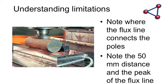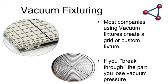The other question people ask about magnets is: what happens to all the chips? Since the flux lines have to go through the part and thin parts are a problem, chips — being very thin — typically don't stick. You're not re-cutting chips as you machine; they're ejecting out. You may have some sticking around the edges of the poles, but it's not significant — they typically fall away. So magnets are a great system if you're doing magnetic material. But if you're doing aluminum, thin-wall parts, oxygen-free copper, or beryllium copper — none of that is magnetic, so you might want to look at vacuum fixturing.